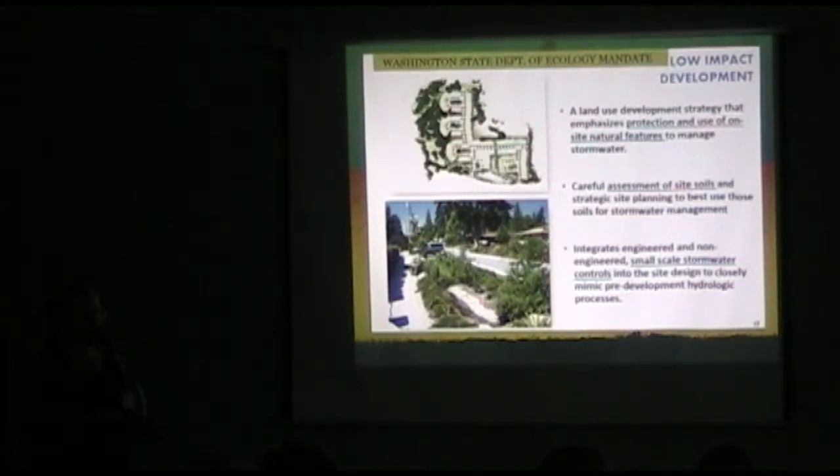And they are to create rain gardens or bio-retention facilities. Also, pervious pavement, which could be concrete or asphalt. I think for the small-scale project, concrete pavers are actually the best. And I just learned that when we often set pavers into sand, that's the old way, but for this method, gravel of very specific sizes, rock and small gravel, are used underneath the pervious concrete pavers. And if sand is mixed in there, it can eventually clog.